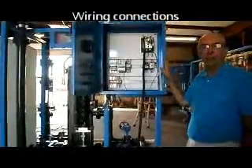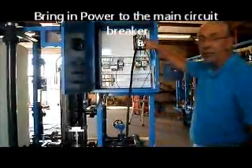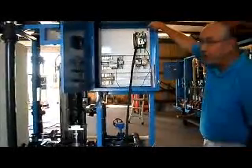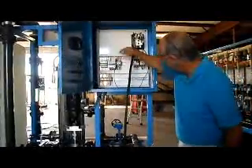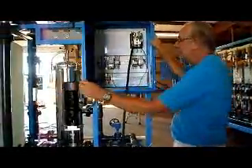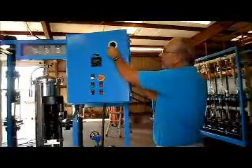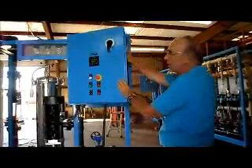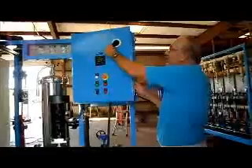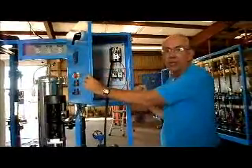The wiring connections are very simple for this machine. All you have to do is bring power into the top. You have a main circuit breaker here — 30 amp service. You're going to bring 50 Hz, 380 volt, 3-phase electrical supply at 30 amps into the top of this main circuit breaker. There's a ground terminal here — bring your ground wire to the ground and the three-phase power to the top. That's the only electrical connection you need to make. Everything else is completely pre-wired. You have a disconnect handle here. If you need to open the enclosure, the panel needs to be in the off position, which disables the power so it's safe to go into the panel. When you want to run the system, this must be in the on position, otherwise power will not be available from the circuit breaker to the rest of the devices.